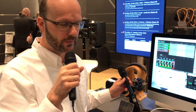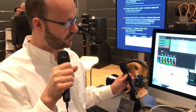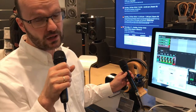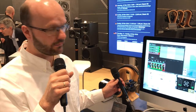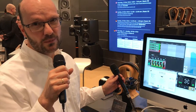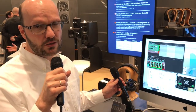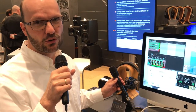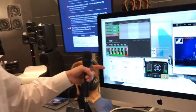Given the fact that you have 360 video possibilities, we would also like to give the possibility to get 360 audio. That's why we chose to revive the ambisonic structure for this kind of microphone. It's a four-capsule microphone with four identical cardioid condenser capsules arranged in a tetrahedral cluster. Out of the microphone comes four channels that you need to be able to record in the field. Those four channels need to be converted into the so-called B format in ambisonics — that's what the plug-in does, the plug-in that comes freely with the microphone.